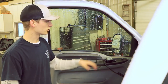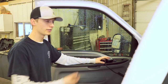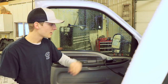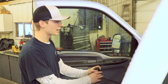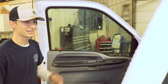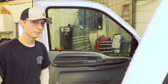Another thing we like to do is have the controllers mounted on the door here — this is by far the most comfortable position. You can have one hand on the controller, the other hand running the steering wheel and the gear selector. Also you don't have the controller just laying around loosely in the cab getting kicked around when people get in and out of the truck. It's on a piece of Velcro so when it's not in use we can just take it off and stick it to the dash here on another piece of Velcro that's even more out of the way, so it's less likely to get bumped or have water get on it.